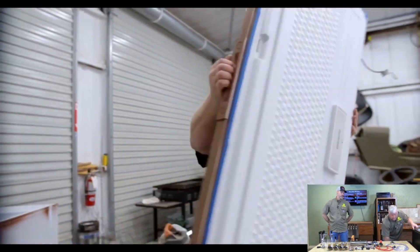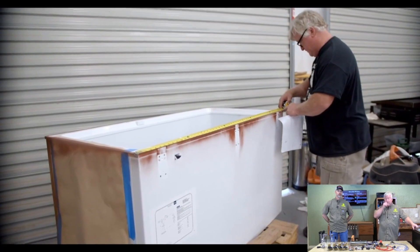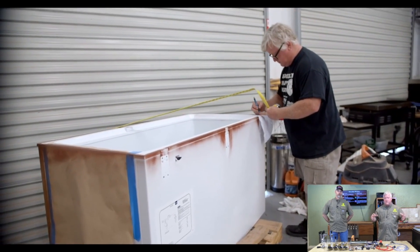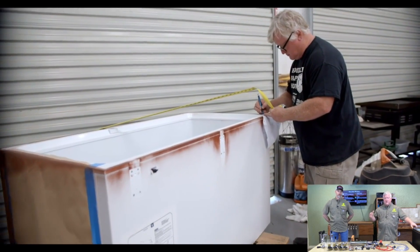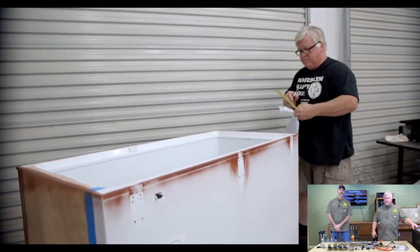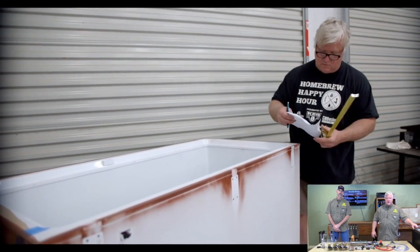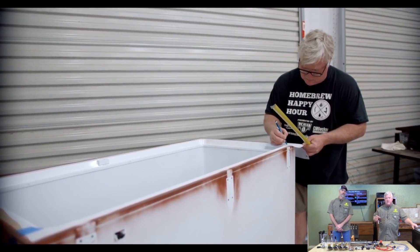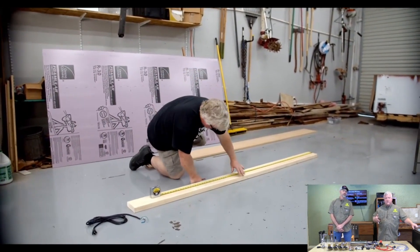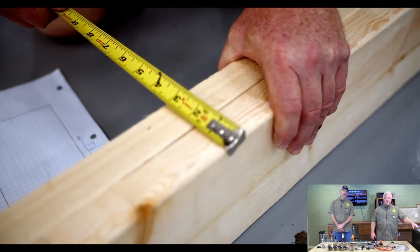I'm removing the lid here and putting it safely aside, then I start my measurements. I always measure the long part first and try to do everything based on the longest board in the front, because that's what you're going to be looking at. Then I do the one in the back exactly the same, and then I'll show you what I do to get the right measurements on the sides. I can't stress enough the idea of measuring two, three, four times and cutting once. What I like to do is measure once, make the mark on the board, go back and measure again and make sure I end up at the same mark.